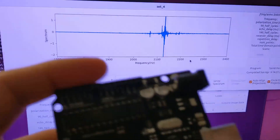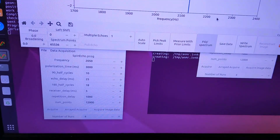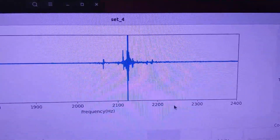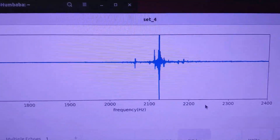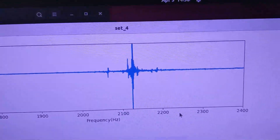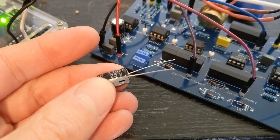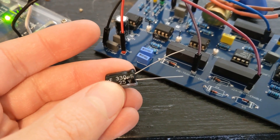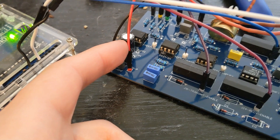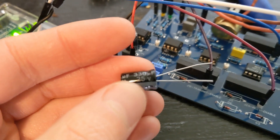The default software didn't want to work for an Arduino Elegoo Uno. Fortunately, I had a regular Arduino Uno on me and that seemed to work. What you're seeing here is a bunch of noise, most likely due to the wall, because I'm powering the plus and minus 15 volts through the wall. According to the low-pass filter calculator, 330 microfarads on the input power circuit should be enough to quiet down the 2000 hertz frequency noise.